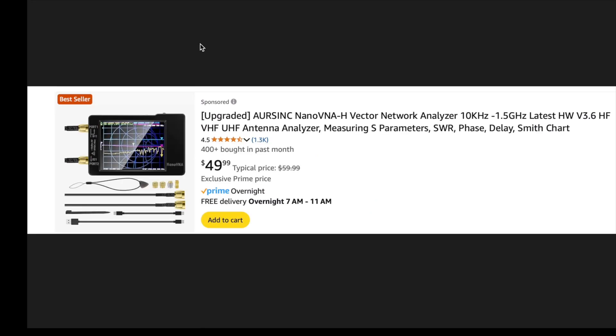How long should the coax capacitor be? You're going to need a VNA or antenna analyzer to see where the loop is resonant. I started with about 3 feet of RG58 for the capacitor and got an SWR dip at about 10 MHz — good, shows I didn't cut it too short. I trimmed its length about an inch at a time, or even less, until getting something close to 14.074 MHz, so I could try this on 20-meter FT8. This same loop will work on the higher bands if you just keep trimming the capacitor and checking the resonant frequency.